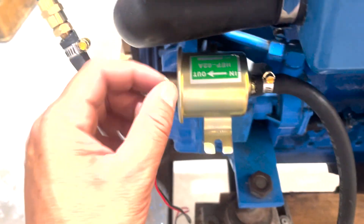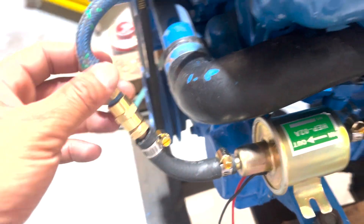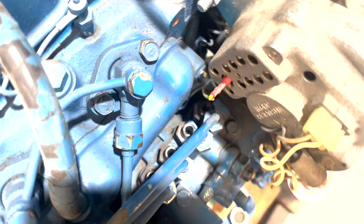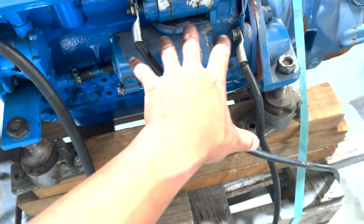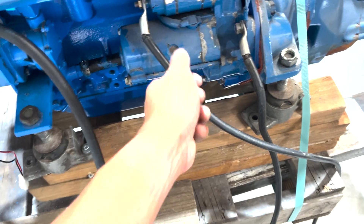Fuel is going to be fed from the tank, sucked up into here — this is low pressure — going into the injector pump now. We're going to give that a shot and see what happens. I've just noticed these lines are loose, so I'll tighten them up. All those lines are tight now. We'll be able to check whether fuel is coming out of those when we fire this thing up. I just need to plumb this pump into something that goes live when you turn the ignition on — I might just hardwire it to the battery for today.